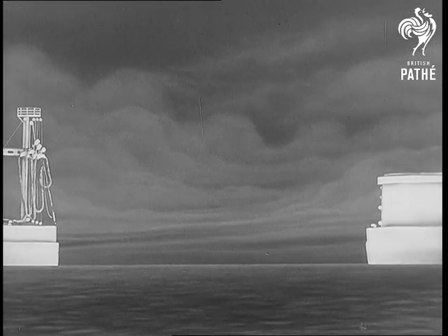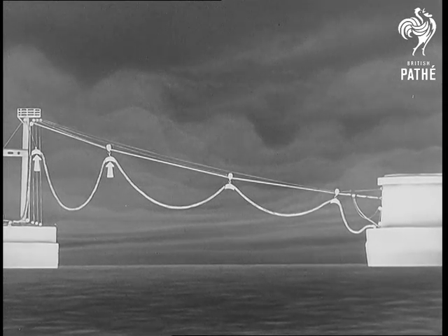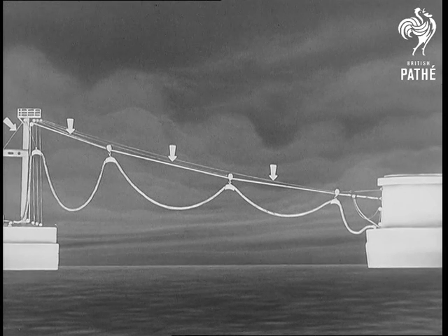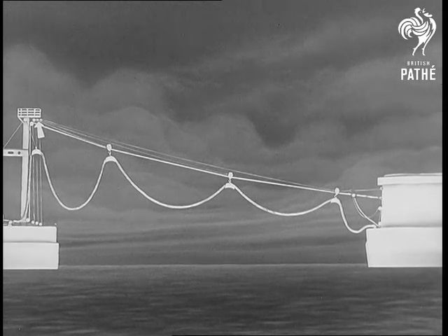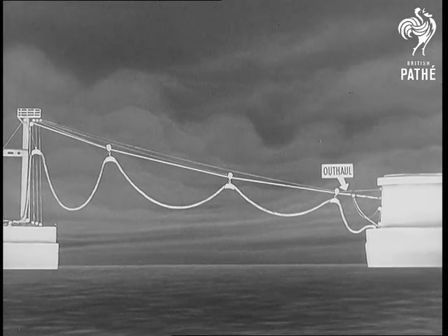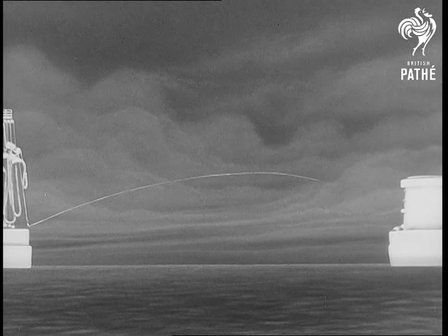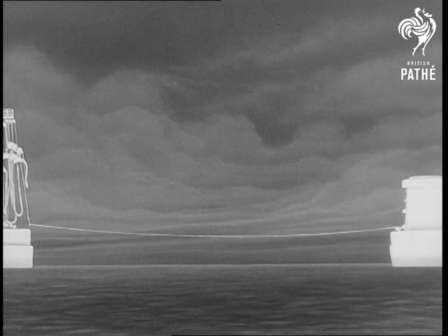Jackstay fueling is an experimental method developed to allow ships to be fueled in heavy weather at a greater distance apart than the large derrick allows. The hose is supported in four troughs, each slung from a traveller running on a jackstay, and from each traveller a whip leads through swivel blocks at the king post head, then through leading blocks on deck to a winch. An outhaul is shackled to the traveller of the outer trough and the hose is hung on a pennant in the receiving ship. The gun line, messenger, distance and telephone lines are passed to the receiving ship, and the jackstay line is clipped to the messenger and hauled across.